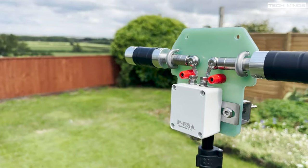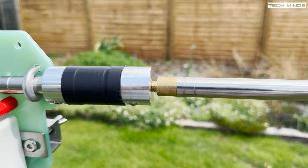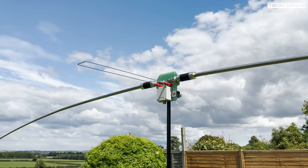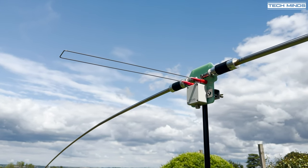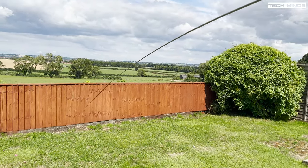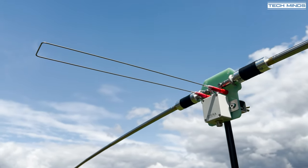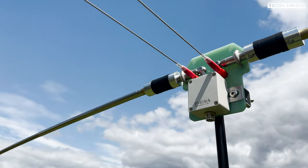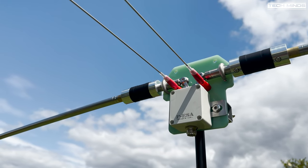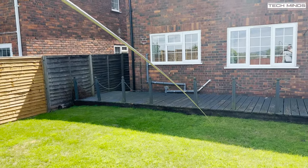For this test I will set up the antenna to work on the 40 meter band, which is 7 MHz. The machining on these induction coils is pretty good and the telescopic antennas screw nicely into them. As this is a dipole, I attach both telescopic antennas one either side of the mounting bracket with both of the induction coils. Then I attach the 40 meter matching loop — no idea what this does or even why it's needed, but it says to fit it in the instructions. The telescopic poles are pulled out pretty much as far as they can go with only one small section pushed back in to get into the ballpark of where we want to be. I'll be aiming for a resonant tune at around 7.1 MHz, right in the middle of the 40 meter band.